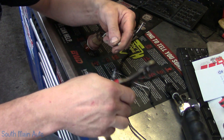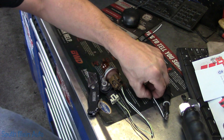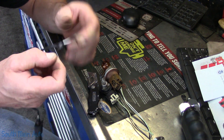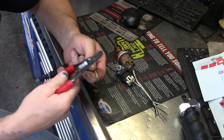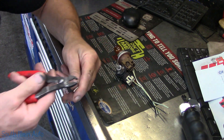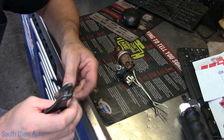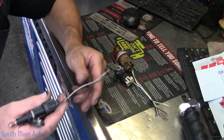I know it's a very simple tip, but I often get this question because maybe people don't know what I'm using or just don't recognize it. So I'll get the tape stripped off this and show you what I do next. Now that I've got them with the tape stripped off, I'm just going to peel back some of the insulation. You only need about a half inch or so. At this point, you can put various ends on them — banana jack leads, use them with our AES Wave test kit, put all kinds of various front probe adapters on them.